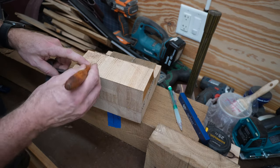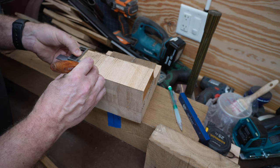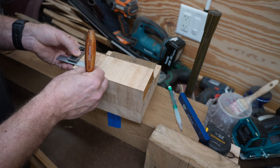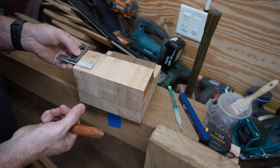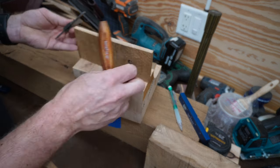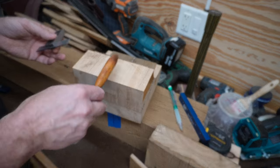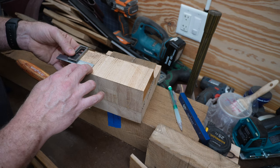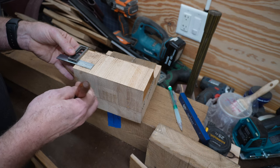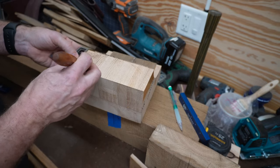So here's the line I made. We've got 1 and 25/32. I'm going to fudge it a little bit to 1 and 24/32, one, to make the math easier, but two, I don't want to end up short on this piece. I need this piece to hide everything behind it. Definitely don't want to end up short on this. So half of 1 and 24/32 is 16/32 and 12/32 is 28/32. So 28/32. Those dashes are small.